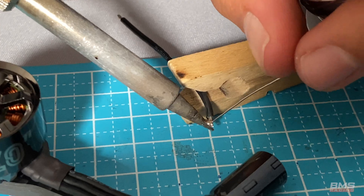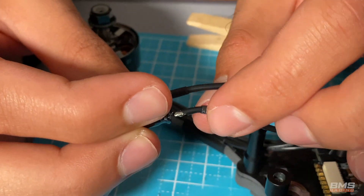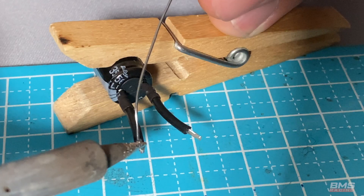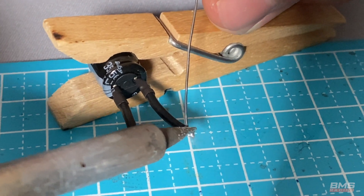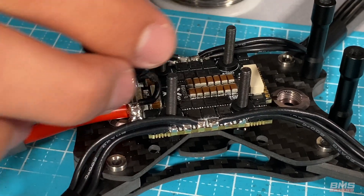I'm hoping to get a lot of life out of this quad, so what I'm doing is mounting the capacitor to the ESC using motor wires. This will allow for a little bit of dampening at the connections rather than having a solid point that vibrations will shake apart. We've got a flexible cable that will just bend and not break.